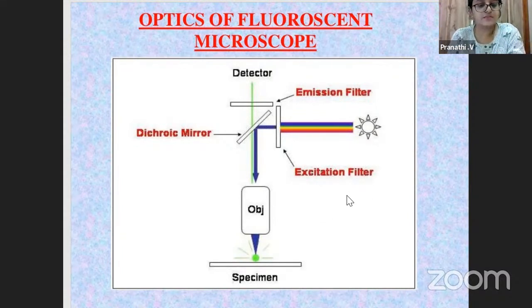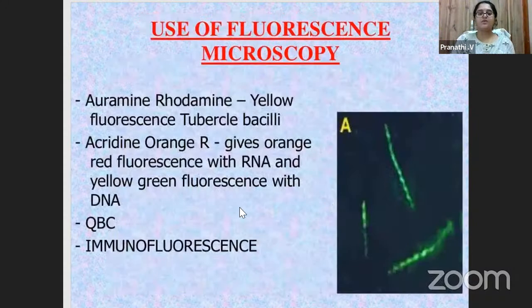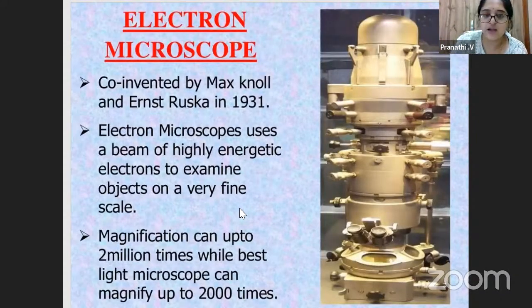And again, you have to maintain the microscope. Give it to professionals who can treat it well and see that there are no issues. We cannot just lubricate or grease it without knowing what to do. You have to maintain the microscope very carefully, and make sure that whatever oil you are applying doesn't go inside the microscope. Then you have to clean the oil immersion front lens by gently wiping it with a soft cloth or a lens tissue.